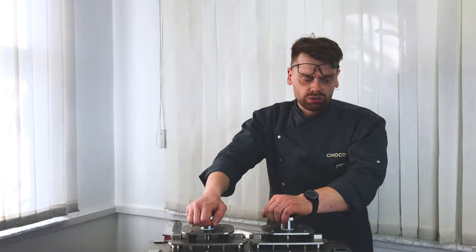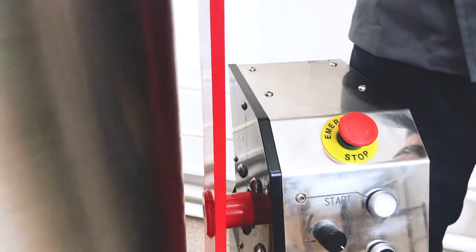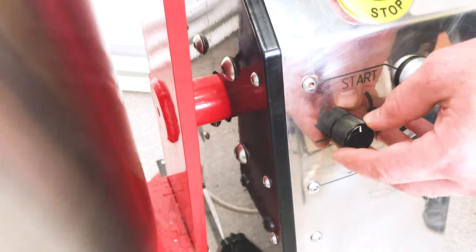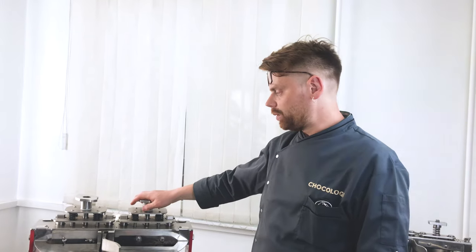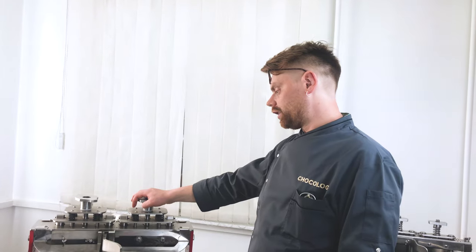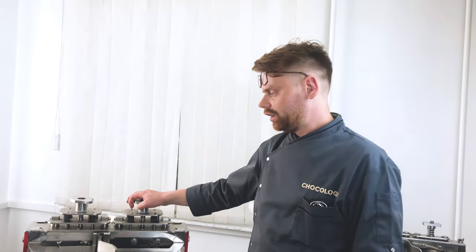And if you need to make milk chocolate and leave the melangeur for one night, you need to control the temperature by reducing the speed or by cooling the air. KADZAMA melangeurs are very good melangeurs. We produce very strong machines for industrial use. The only important thing is you need to use it right.